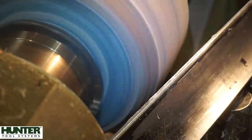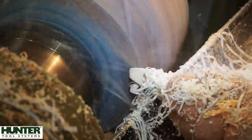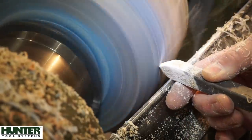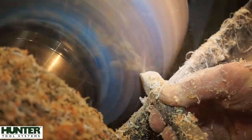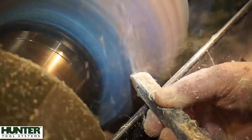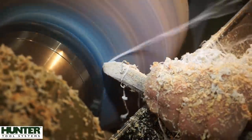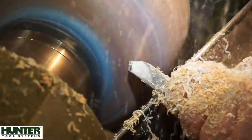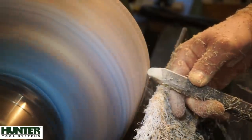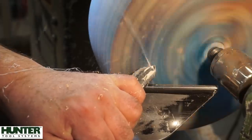Blending in is probably better choice of words than filling in. When I shut the lathe off you'll see some areas that have got some chip-out - that's just because maybe things aren't perfectly round or I'm being too aggressive. When it comes to turning resin I've said this in the past: slow and steady wins the race. You cannot be aggressive with resin - if you do it's going to either explode on you or you're going to have massive amounts of chip-out and you'll have to alter your design.